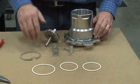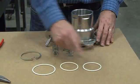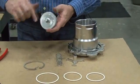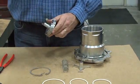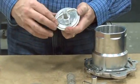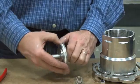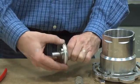Here are the seals that will come in your seal kit. There are two poppet seals and a larger O-ring or face seal. We'll start with the first poppet. Clean the groove completely, removing any particles, and place a small amount of seal lube around the poppet. Then slide the O-ring over the poppet, carefully but firmly pressing the seal into the groove. It's important that the seal is completely seated to prevent potential leaks.